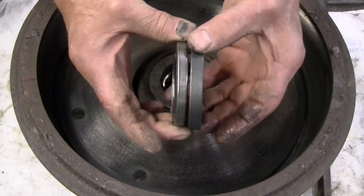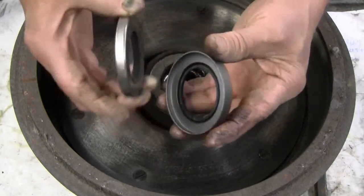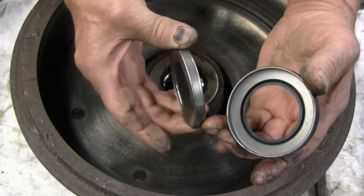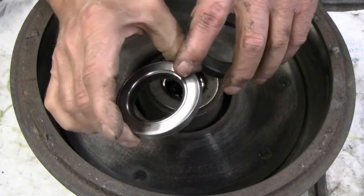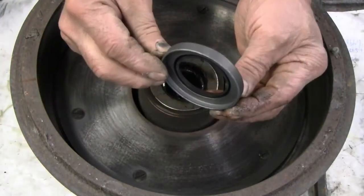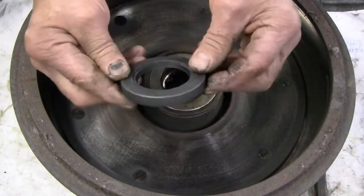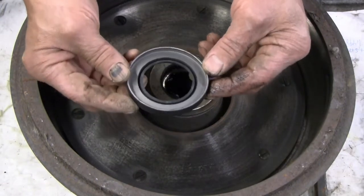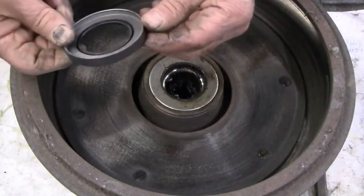The new grease seals are a 1/16 of an inch thicker than the old ones, but they're relieved on the inside, whereas the old ones are flush. They're felt seals with metal rings on both sides that take up the full 5/16 depth. So I've found that these seals will fit in, and the recess on the back side leaves plenty of room for the bearing. So it turns out not to be an issue. Just drive them in flush with the face and all is good.